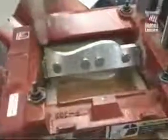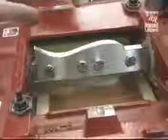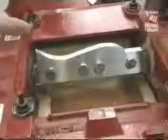Last time we used the molding machine to make the cornice molding. Since that time, I've installed another set of knives. I fax the profile to the supplier. They grind the knives and ship them to me. Then I mount 2 knives in a head which spins at very high speed, removing the material.